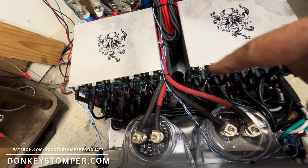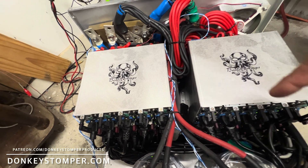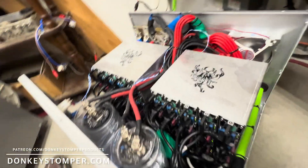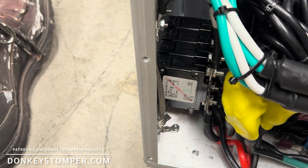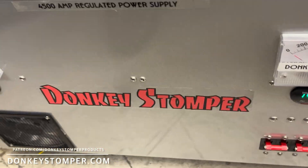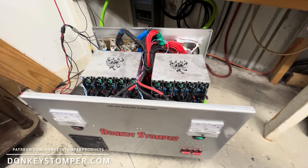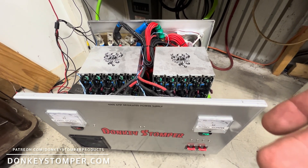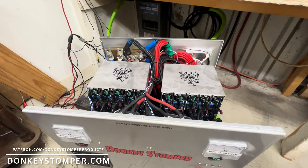I've got 16 gauge AC power cords and I put 10 units at a time to eight gauge, 10 at a time to eight gauge, and hooked them to my breakers. I've got 100 amp breakers up front — 50 amps on each 20 units, which is pushing it, but that's all the electricity I've got. I figured it wants about 363 amps to run it at full load of 4500 amps, and I'm on a 200 amp entrance. So that's not going to happen — I probably have about 100 amps coming to it. But we could still get up there pretty good, and it would do 4500 amps.